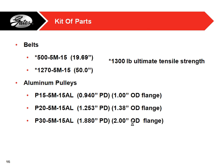The 5mm pitch is more comparable to a 25 chain. You'd probably want to go to about a 25mm wide belt for a 35 chain, which is about an inch wide. Another reason we don't give the 25mm out is because we don't actually make pulleys for 25mm wide, so it's hard to get pulleys to teams without custom making all of them. The 15mm wide seems to work for most teams.